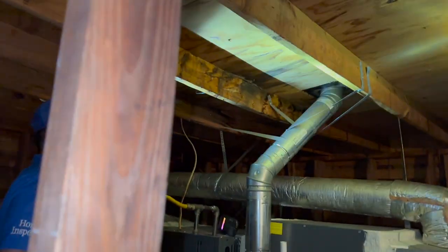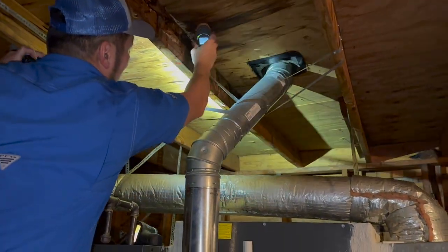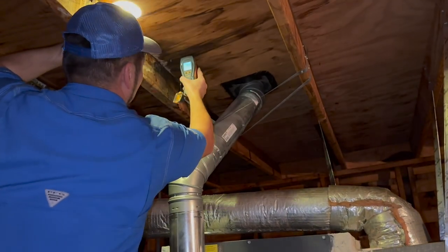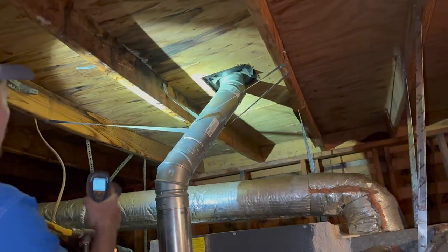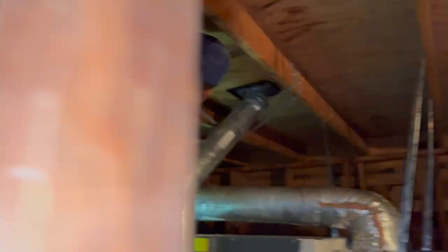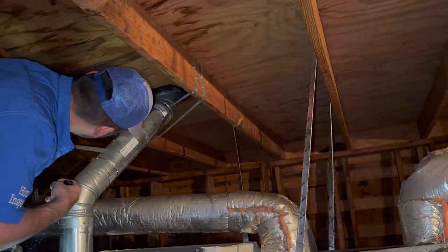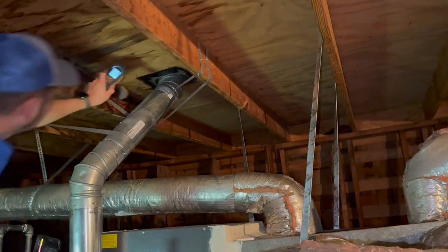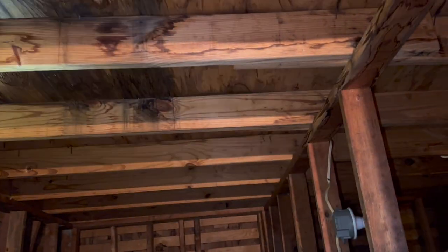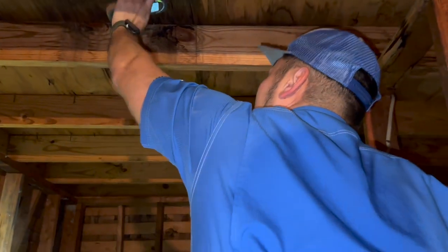You have a bunch of stains over here — that's got to be active. We have to go with a little stabby-stabby action with the moisture meter. It's dry. What about in the white over there? It's on my side, closer to the beam. You got some over your head over here too. You got a little bit right here too. But that didn't show up any colors at all on the thermal — so they just didn't replace the decking.